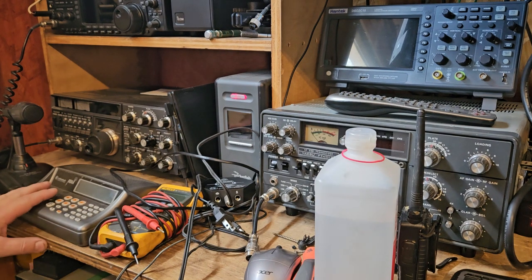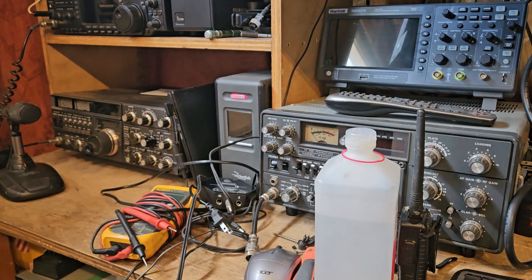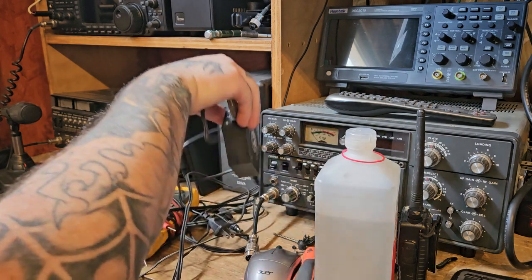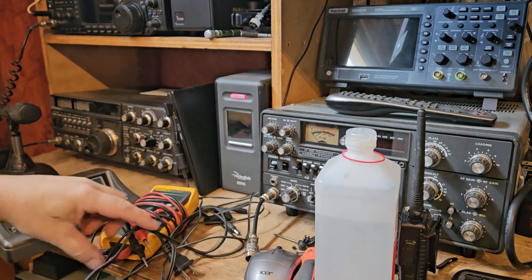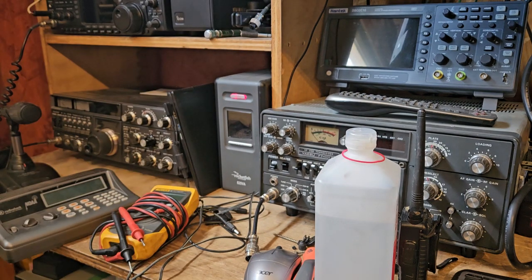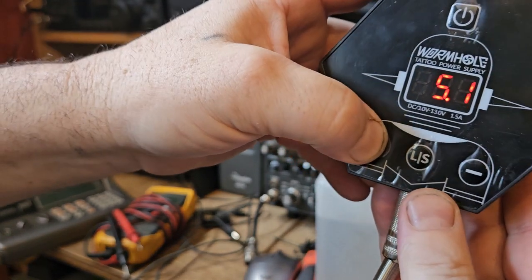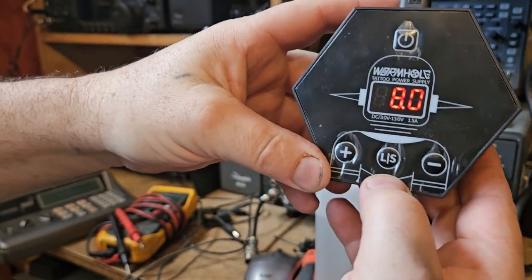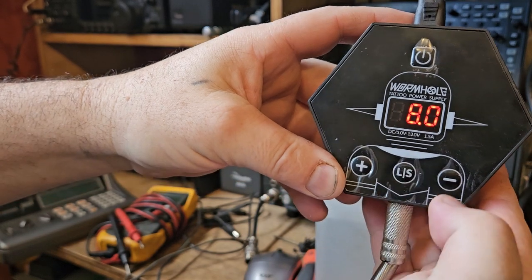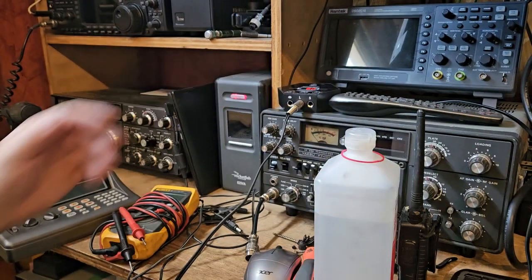So, it's a 9 volt, center positive, smaller type. And so what we're gonna do, we've got a tattoo power supply here, and this actually can be set to on all the time. You don't need a foot switch always. So we're gonna plug that in and we'll turn it on. We'll bring it up to 9 volts. We'll just start with 8. And then we'll hold this down, it'll flash, and then it should be on. So we'll set that up there.